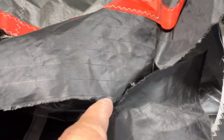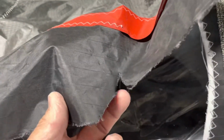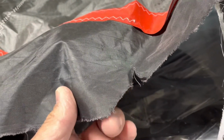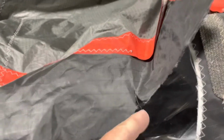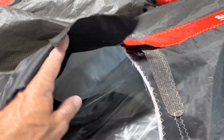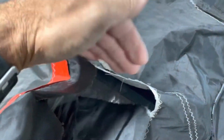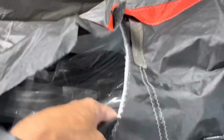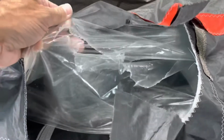I've kind of trimmed this because it shredded it, where the cut will be pretty much clean, whatever cut it. But it was a good 1.25, 1.5 inch cut there. And then because wings are under very, very high loads, you can tell they're double layered from here to the center, and it took the load, blew the load out, and exploded the bladder.